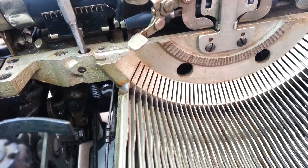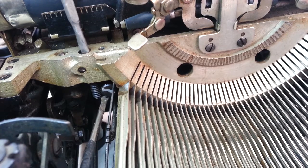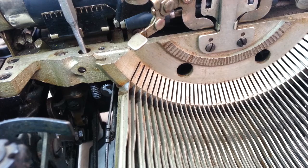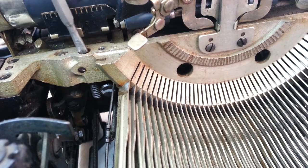So if we turn this clockwise, the band is actually getting less tension. I put a line on this right here so you can see it's turning that way, which would loosen the mainspring. So counterclockwise on this screw up here tightens the draw band tension — tightens the mainspring — because counterclockwise down here tightens the draw band. Clockwise loosens the mainspring.